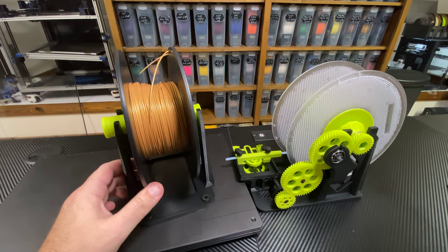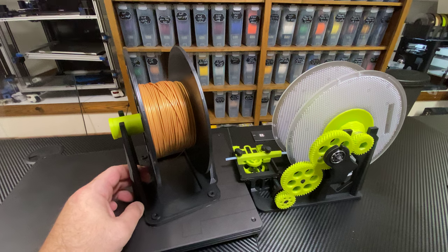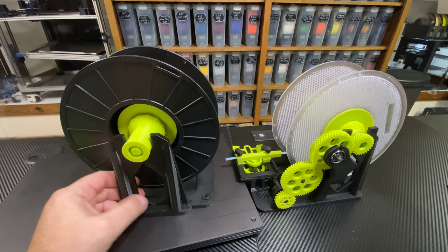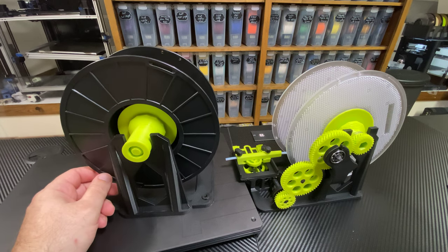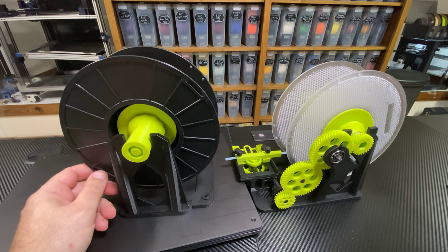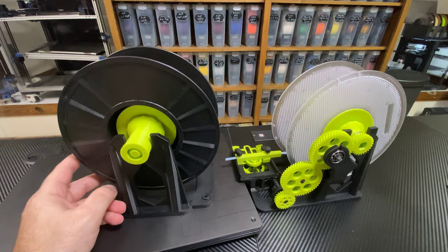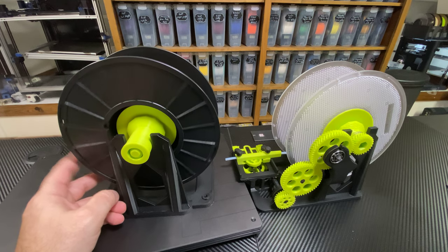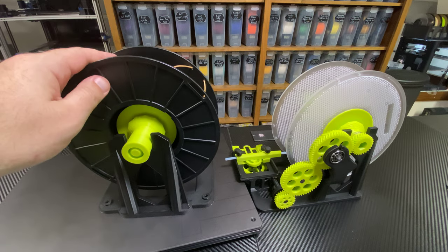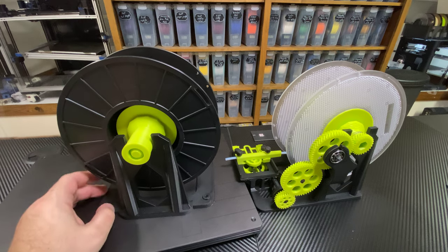This KVP spool here is almost 74 millimeters wide — it's really wide — and it is too tall. The spool actually doesn't let the lid close. I also found that it will try to unload too fast, spinning the filament spool too fast. When the spool is really full, it'll spin it too fast, pull on the filament too hard, and cause errors.